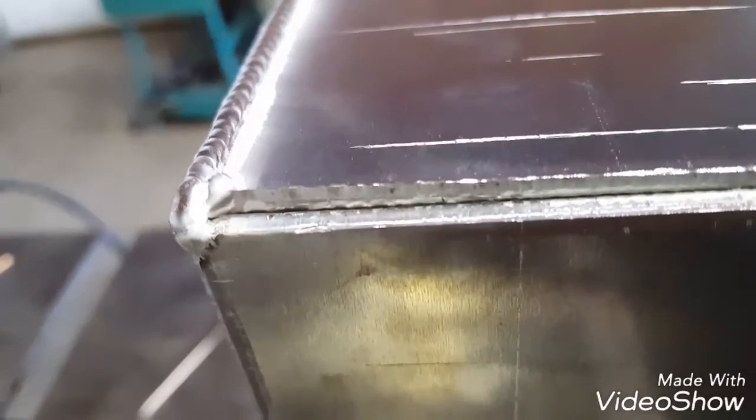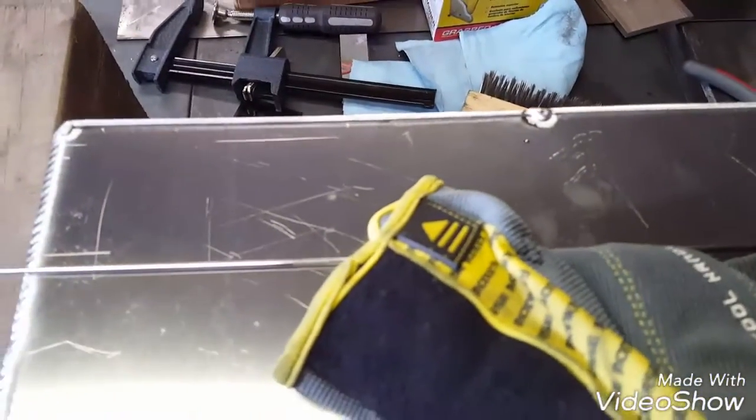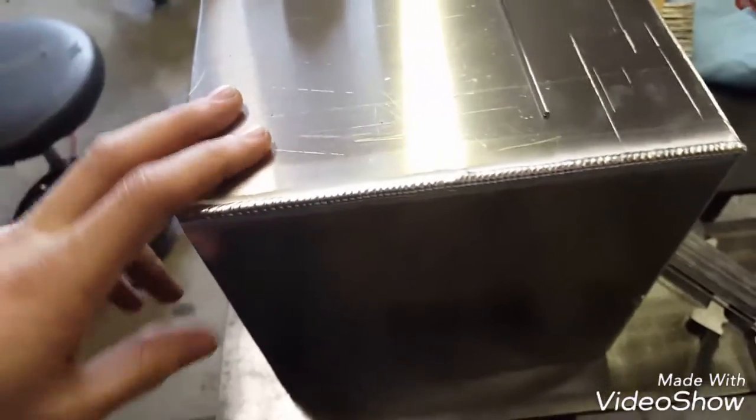I like to have them edge to edge — that's a good fit-up. It's not clean or anything, but edge to edge like that. As we get down here, now it's reversed, and that's going to weld up crappy. You'll be able to see what I mean when I'm done — it's just not fun, it's hard to keep your bead width exactly the same. So I'm going to talk about bead width.